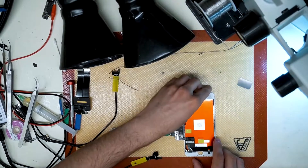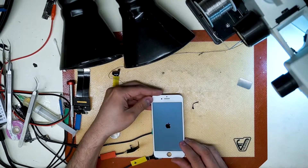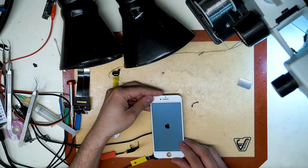The CPU crystal is now installed and the device is booting normally. As a recap, we had around 20mA pulling on DC power. We know that this means that the PMIC is working and the CPU isn't.